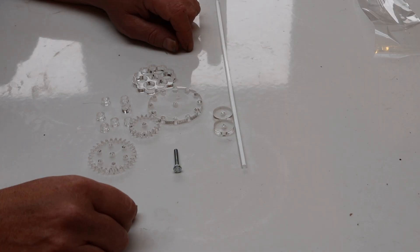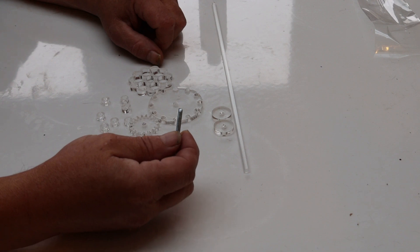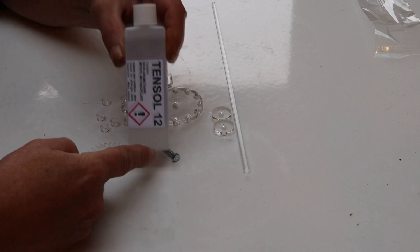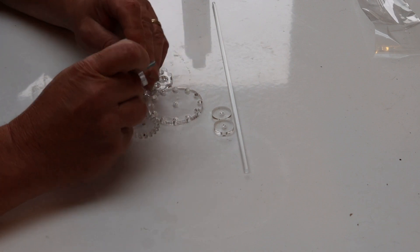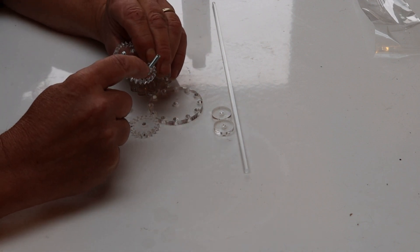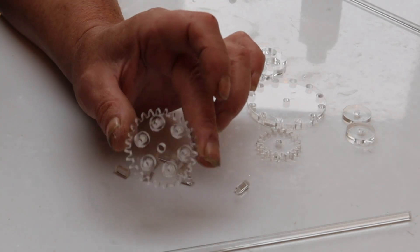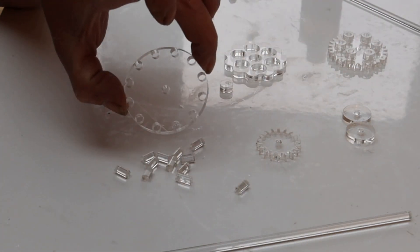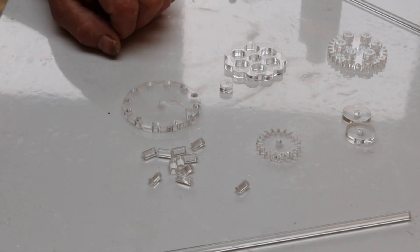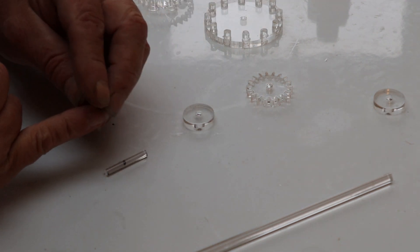Let's get that cut out. There's our collection of parts. We'll also need a bit of 4mm acrylic rod and a 4mm bolt. To glue everything together, we're going to use Tensol 12, which is simply the best glue for acrylic ever. To start, take the gear with the six holes in it, stick the bolt through that, then take what looks like a spacer and pop it on there so we're centering it above the hole, add a spot of glue to hold everything together, and continue doing the other five. Then cut twelve 1cm lengths of 5mm bar and glue them into each of those holes. Then take a bit of 4mm rod and, 15mm down, glue on the eccentric cam — you'll see that the hole in the center is slightly off-center.